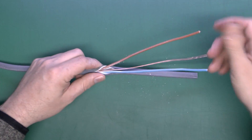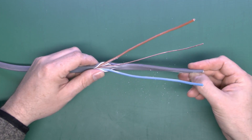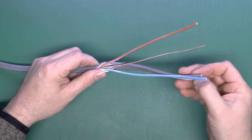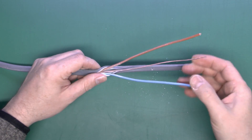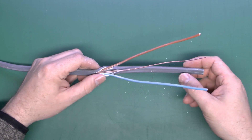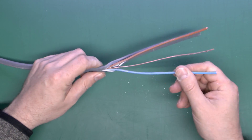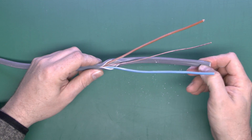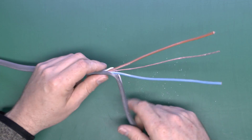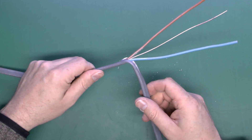You'll notice this one has a white powder inside, which is a kind of talc. That's primarily there so that the covering doesn't stick to the inner insulation. Some cables have been made incorrectly without it, and when you come back to fix the ends you find you can't detach the grey covering from the inner insulation — it tears and makes a mess. So if you get a new roll, it's always worth splitting the end open to check the inside can be easily separated.